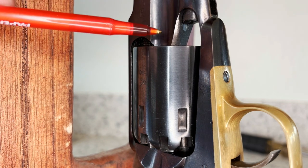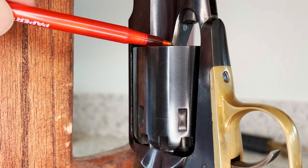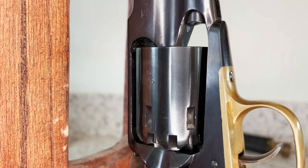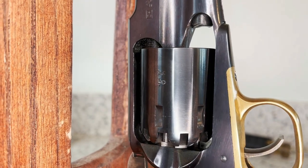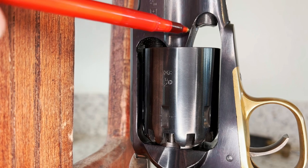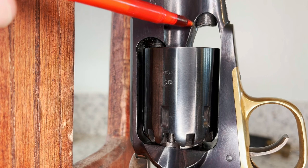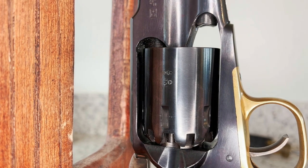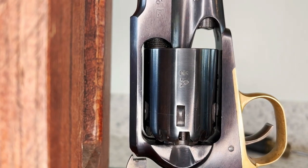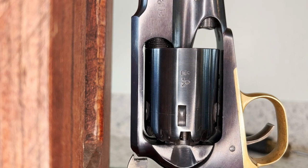That took about 10 minutes. I'm trying to show you where I removed the metal from the frame — from that area down into there. I used files to do that, so you could probably do it a little faster with a Dremel or rotary tool, but you can also mess up a lot faster with those too. So I filed off a little, then put the cylinder back in the pistol to check if it was clearing the bullet, then filed a little bit more. I didn't want to go too far, but I've got enough now that the bullet clears just fine.